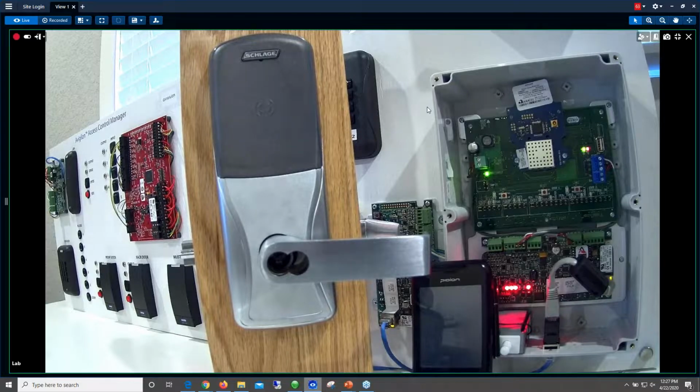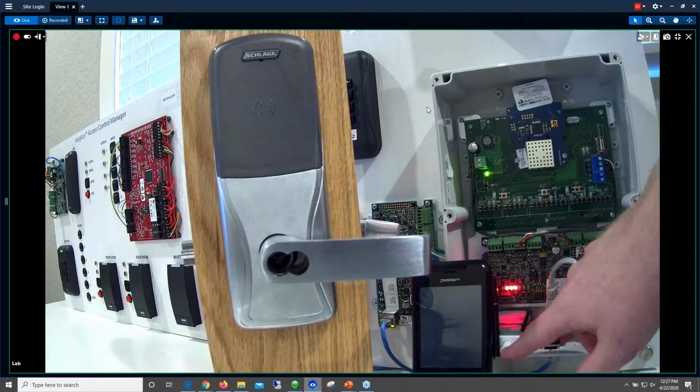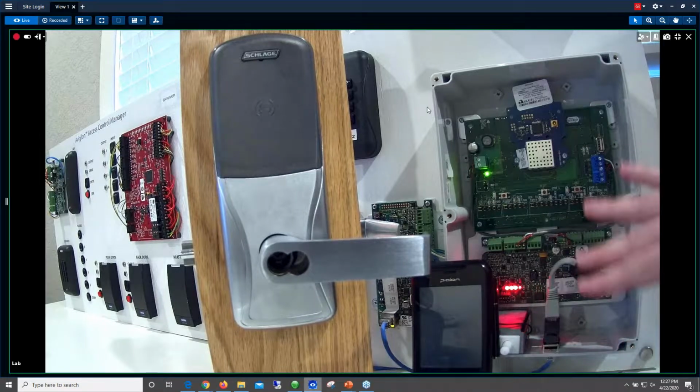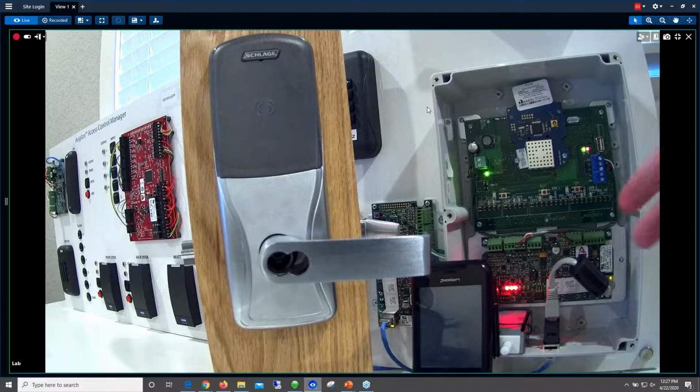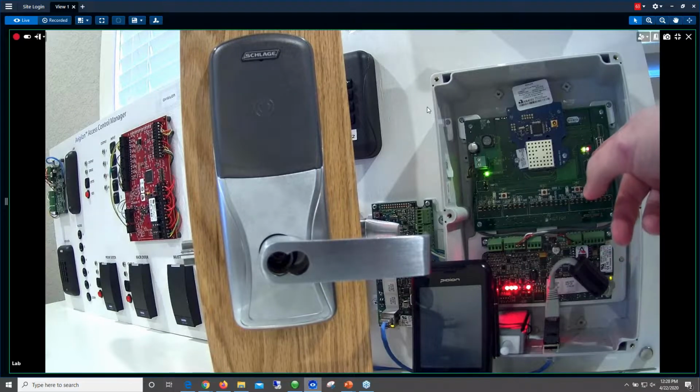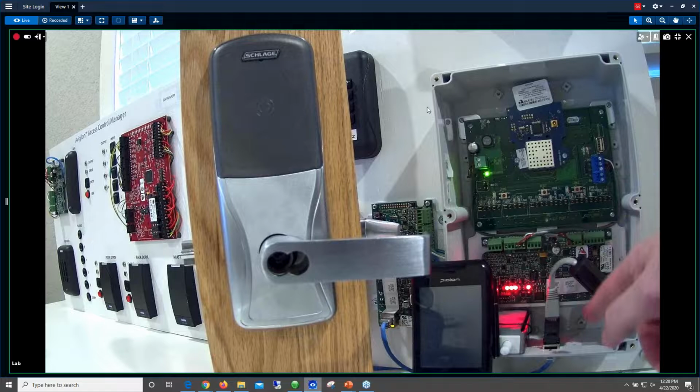And in this case, activating the tamper switch. I've removed it again. Like I said, it's a little bit easier for me to get to just because this isn't mounted in a typical place. Also keep in mind, if you're using this for your first PIM module and you're going to have additional PIM modules down the RS485 chain, you could remove this connector, and that leaves a hole where you can take your RS485 connection down through the hole where the USB connector was, and take it out to the next PIM module.